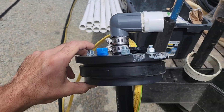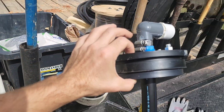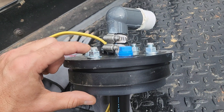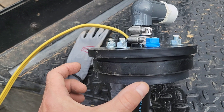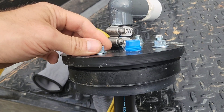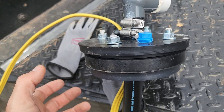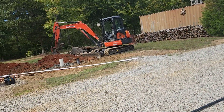A little understanding of well seals: these bolts work with a sandwich plate — you have your top portion, your bottom portion, and a rubber piece in the center. As you tighten the bolts it squeezes the top and bottom and the rubber swells outward against the casing. When you go to pull it in the future, you don't ever take these bolts out — you just loosen them a little bit, and that will help the rubber decompress so you can actually lift it out of the well. Never take these bolts out. Now let's drop it in the well.